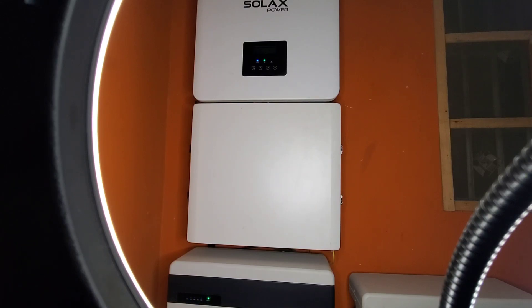Victron says I could discharge 3,500 to 3,800 watts and it's conditional on temperature — once you go over 25 degrees it will derate. This Sola X does not derate at 25 degrees; it derates at a much higher temperature. The Victron has fans; this doesn't have fans. Once you push high numbers through the Victron, the fan kicks in and makes noise — it has to cool the internal components. Think about it: at 48 to 50 volts, if I'm discharging 3,000 watts, that's 60 amps. If I'm discharging 6,000 watts, that's about 120 amps — and at 120 amps you can imagine the size of the cable required at 50 volts.